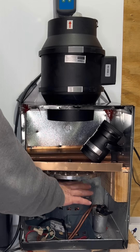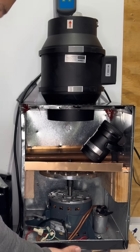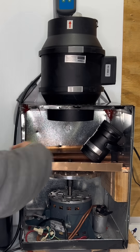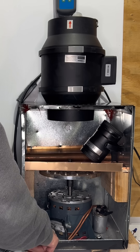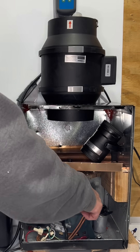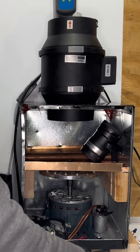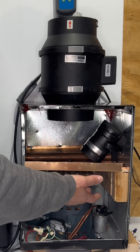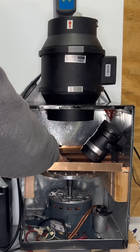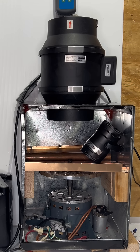Hopefully, because of the magnets and this fan, we can generate some extra heat. I also forgot to mention we're going to use the heat generated by the motor itself — that's why this fan is located over here. There's an opening at the bottom of this duct, which is a 12 by 8 duct capped at both ends. At the end of the duct there's a 6-inch opening. I'm trying to pull air through the hot motor to pick up that heat, plus generate more heat on the copper bars, to get a much higher temperature on this side.